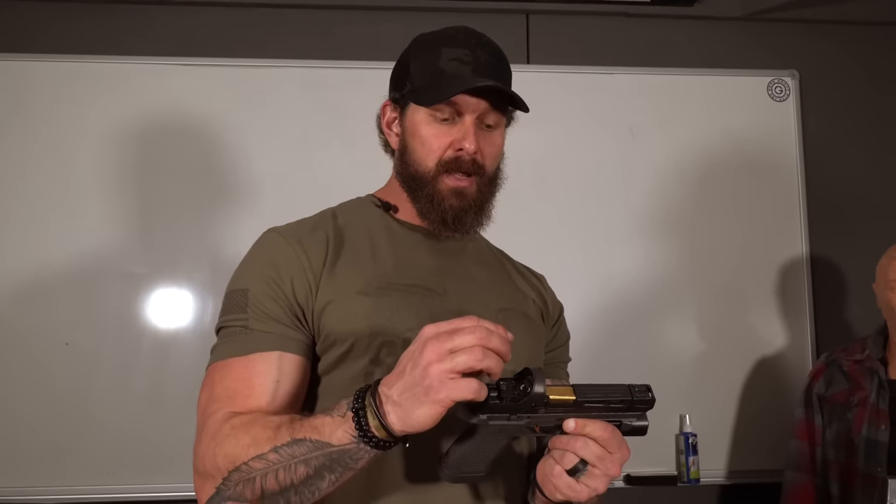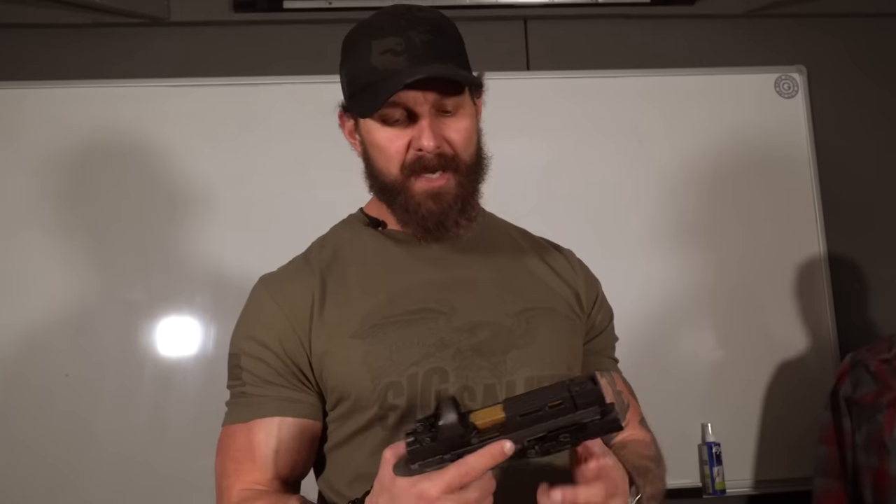Iron sights are really good. Comp's perfect — it's timed, you don't have to really mess with it. A lot of guys, that's like their big thing. They don't know how to install them, they're trying to do it on YouTube and they put it on too tight, and now you're not getting the tolerance or the separation between comp and slide, so you're not getting a full ejection. Maybe it's too loose, untimed, cross-threaded, off 10 or 15 degrees. We don't want that.